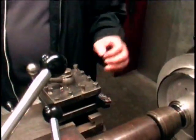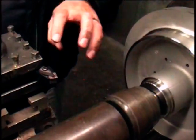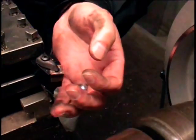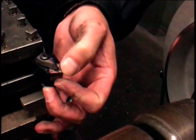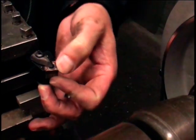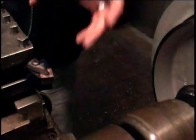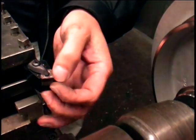So this tool is intended for use on the stainless steel parts. It's a double-sided insert and it has four corners, so it can be flipped over. The condition of the tool itself can be checked just by rubbing a fingernail on that cutting edge — it should feel smooth and uninterrupted, and you know that cutting edge is still good. We've made two cuts with this so far and it's in good working condition. So we're going to set this up and take a cut.